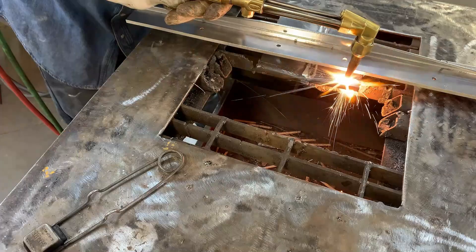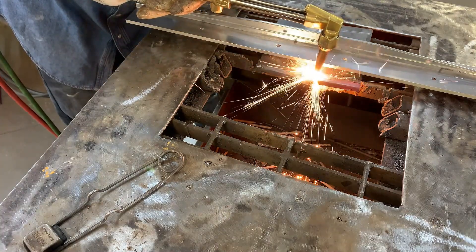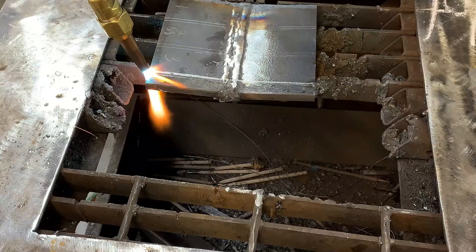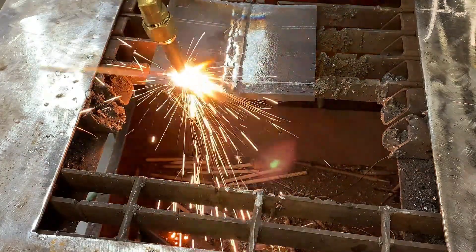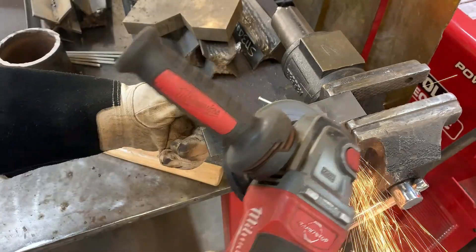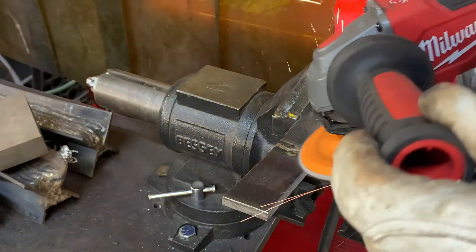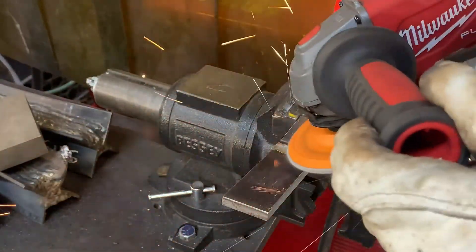Once you've got that backing bar off and the torch out already, chances are you're going to use it to cut your coupons — your one and a half inch, or whatever your standard requires. Always use a straight edge if you can't keep your hand steady; otherwise, free hand it and get that practice in. Once you've got your coupons all cut, we want to clean them up one last time — clear off any slag, get rid of sharp edges, clean the cap and the backside. We don't want to give that inspector any reason to poke around further. Presentation is so important here.